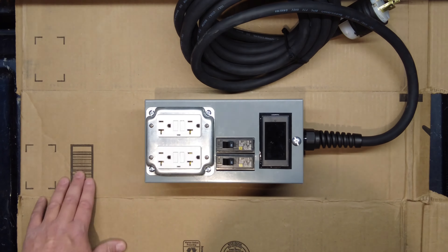For mounting, I measured everything I wanted to install, drew it in Inkscape, printed it on sticky-back paper, and stuck it to the front of the enclosure. Then I used an air-powered body saw — like an air-powered Sawzall — to cut out the holes. One hole didn't turn out perfectly so I added a black vinyl decal border, which actually looks better. I then mounted the outlets into an industrial cover, mounted that cover to the box, and made everything fit.